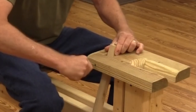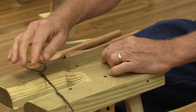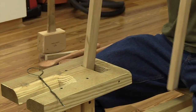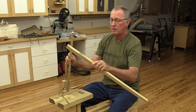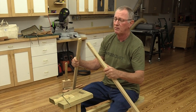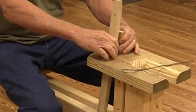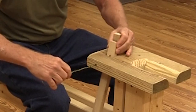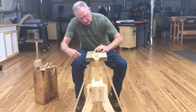The jaws are held in place with a piece of wire — just a clothes hanger that I've wrapped around to make it a little bit stiffer. The legs fit in the slot in the head here, and you'll see that I've got an angle cut on the legs. I made these out of poplar to give me something a little more stout than pine, with a little more flexibility. So they just slide back in, and you stick the wire in here. The wire is flexible and allows the jaws to move so they conform better to the work piece.